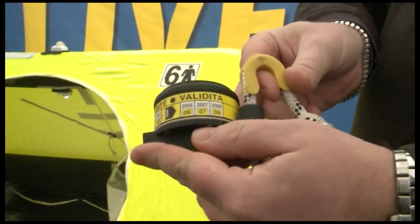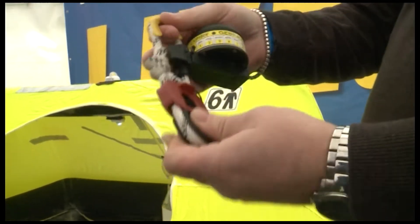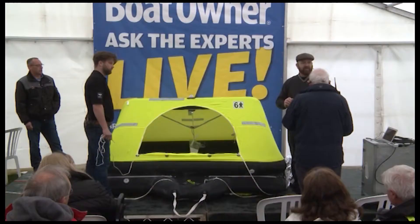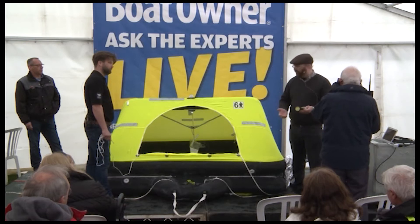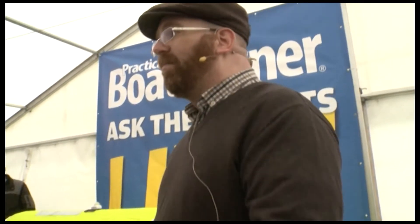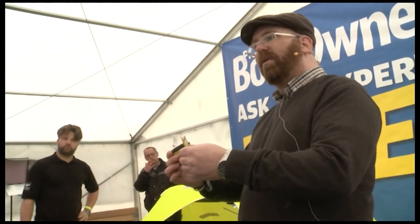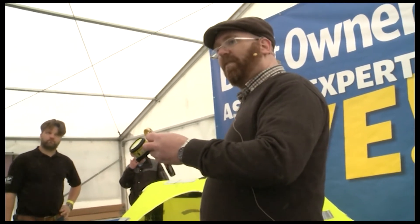You can see this one is already overdone, but it's just to show. This one is connected to the cables of the cradle and the liferaft. So if the vessel goes down and you don't have time to activate it yourself, don't worry. Because at a depth of more or less between two and four meters, this little device cuts the rope and when the vessel is going down, it activates the liferaft as well.